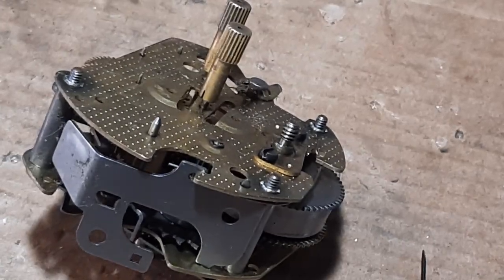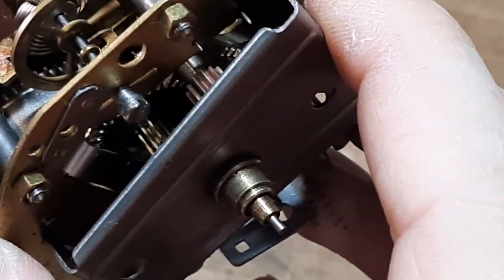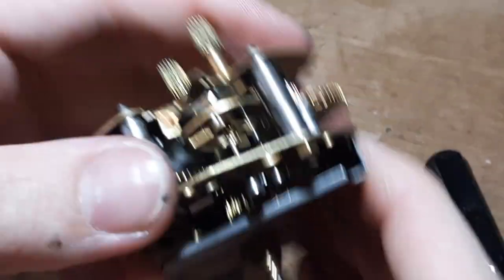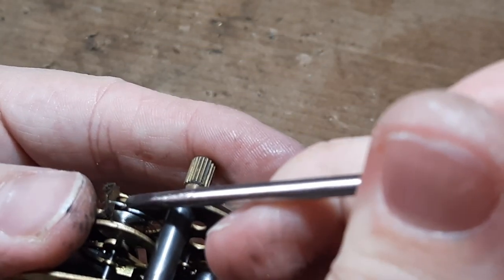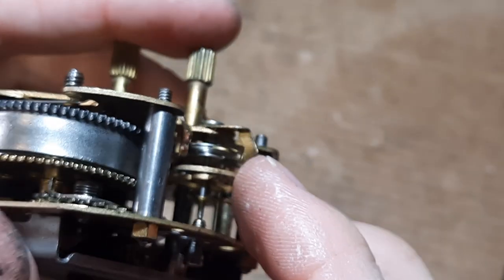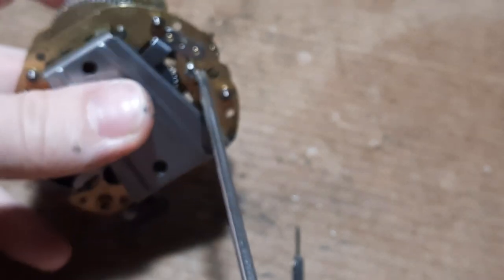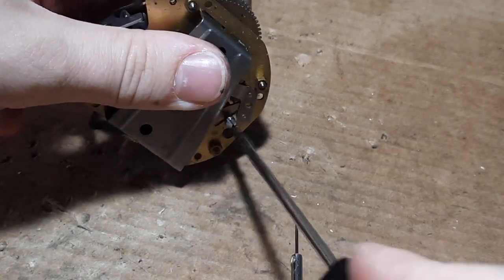This requires a bit of luck, because sometimes the glue is different and it's put on in different ways per clock. And if you have one with glue that is solidly in there, it can be much harder to get the spring out without damaging it. However, I'd say it's about 95% of the time perfectly easy. If we take a closer look we'll see that the tail of this spring is no longer in the brass plate, and if we keep rotating the balance wheel this way we will eventually be able to remove the tail of the spring through this other slot here, which is the regulator.